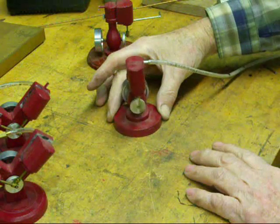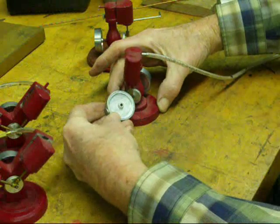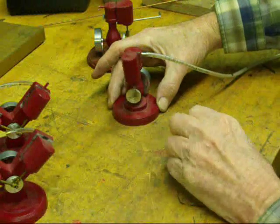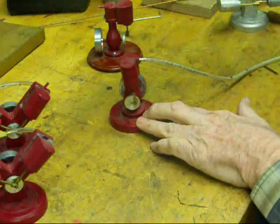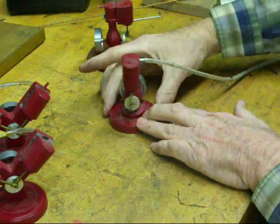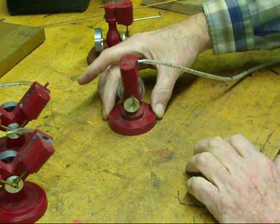The bore is about three-eighths of an inch. The flywheel is about an inch and a quarter or an inch and three-eighths in diameter. These engines are all single-acting. That means we have a power stroke only from the top, not from the top and the bottom. That's why you need the flywheel to carry over the momentum.